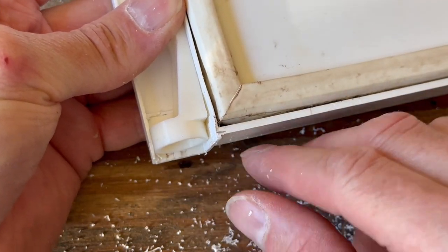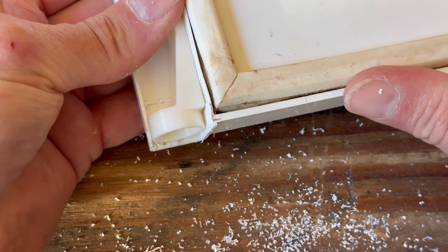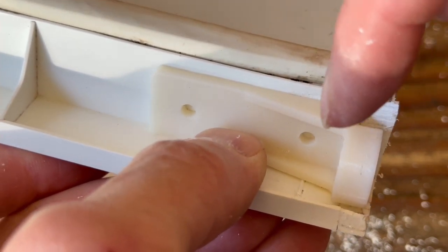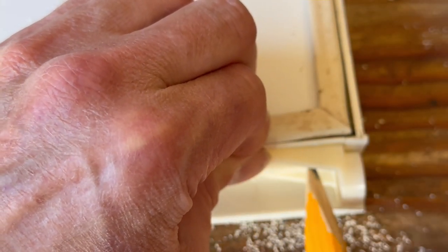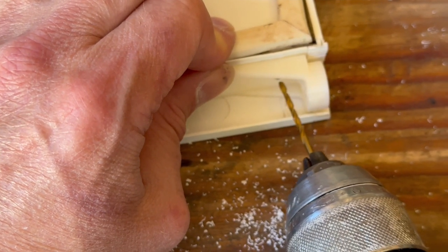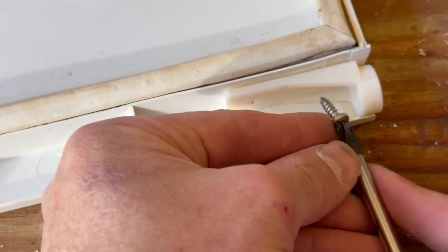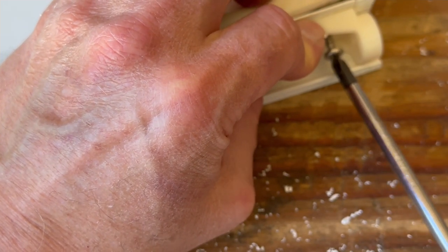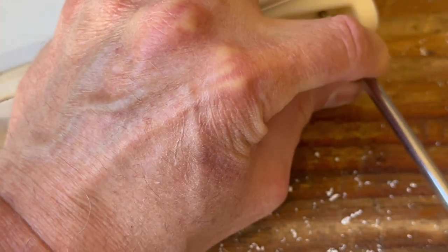Once you have the old plastic removed, adjust the surface of the new hinge plate to meet the pencil mark you put on there, then mark the position of where you're going to drill your pilot holes. Then drill the pilot holes. Finally, take your number eight by half-inch screws and screw them into the holes and just hand-tighten them. Remember you are dealing with plastic, so do not over-tighten these — if you use an electric screwdriver or a drill you may over-tighten them and strip and break the plastic.